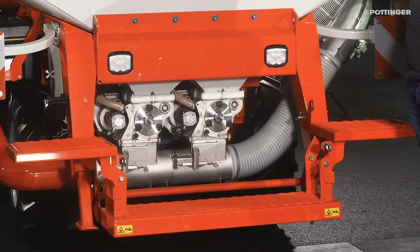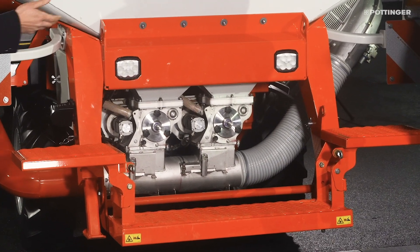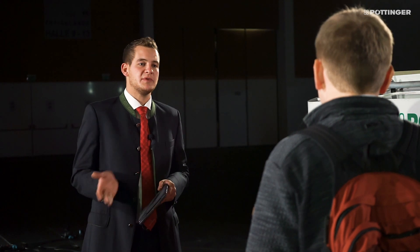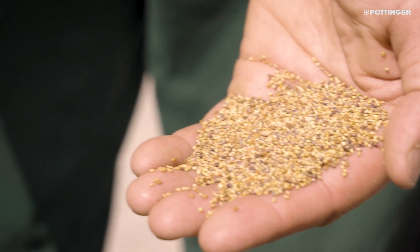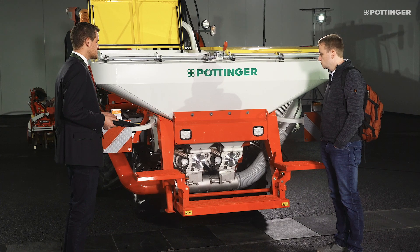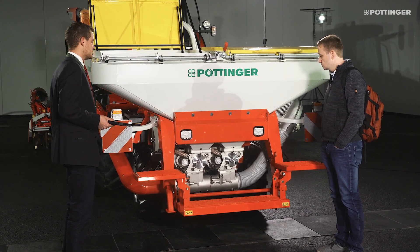As you can see, both metering systems feed into one seed tube. This system is called single shoot. It's used especially for sowing wheat while simultaneously depositing fertilizer directly into the seed slot, or when mixing different seed materials that are not of the same size, or with wheat and seed materials with different dressings. You can simply mix them and sow them simultaneously into the seed slot.